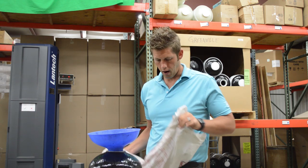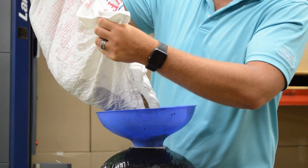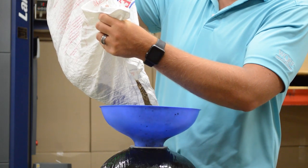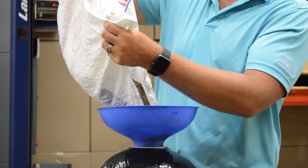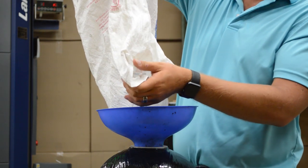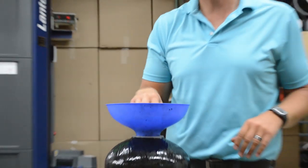What you're going to do is go ahead and open up your gravel. I'm pouring slowly. You want to make sure that your distributor tube does not move — it stays in the center. It's always good if you have someone to give you a hand; they can hold the distributor tube. Your gravel is going to provide a good base to hold the distributor tube down.